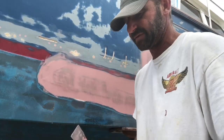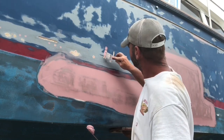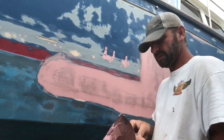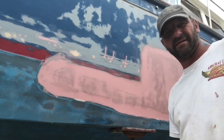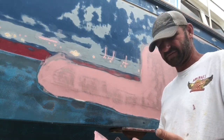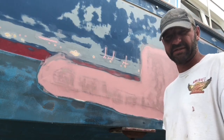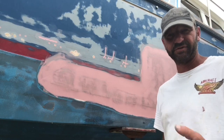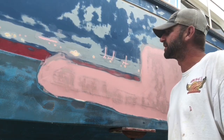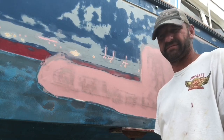Hope I don't block the camera so y'all can see what I'm doing. That is good to go. These spots are good. You know, it's better than the rest of the boat. And now that'll dry. I'll quick sand. I'll do a second and a third application of Awlfair, and then those spots are ready for primer. So it's a really quick process, quick 5-minute job, like they always say. Yeah, right. But anyhow, so this is how I fix cracks. See you soon.